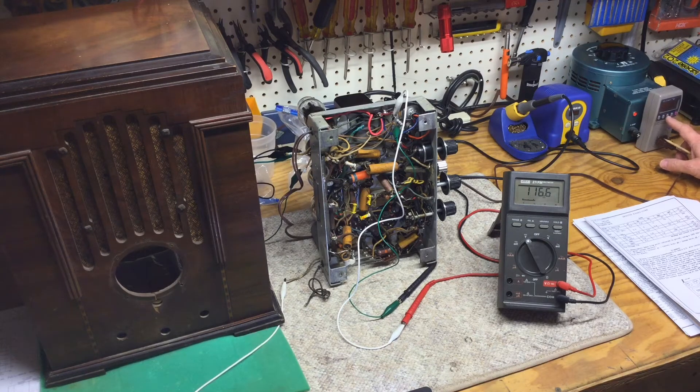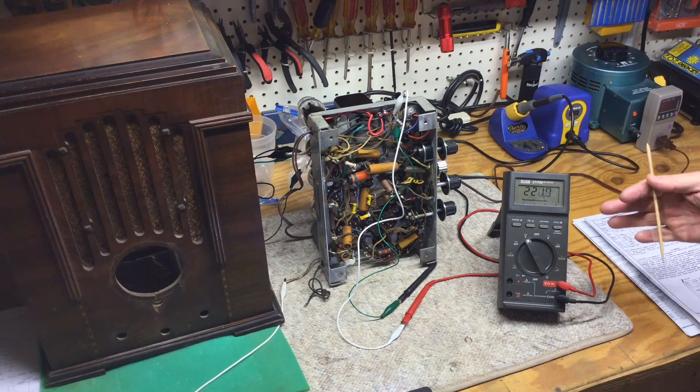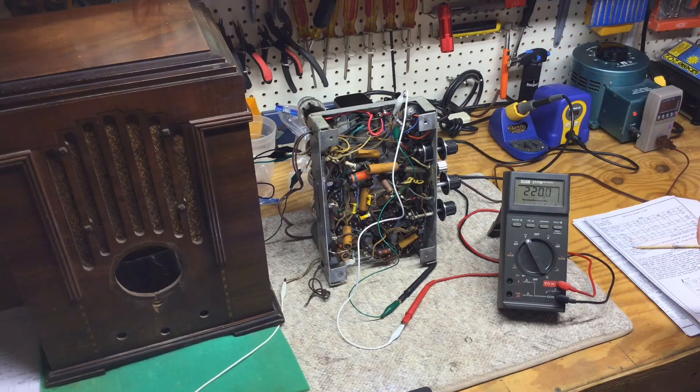Everything seems to be stable. I'm going to go ahead and bring this up to about 75 volts — I'm actually at 78 volts. Quickly toggling back, I'm at 0.25 amps of current, climbing to 0.26, 0.27, 0.28 — making sure we don't have an issue here. That's actually surprising. My DC voltage is now up high enough where the tubes would work. I'm at 221 volts DC, and I do have some racket out of the speakers — not sure if you can hear that. So we've got some white noise there. I'm at 0.29 amps of AC current. No smoke, I don't smell anything — that's a good sign.